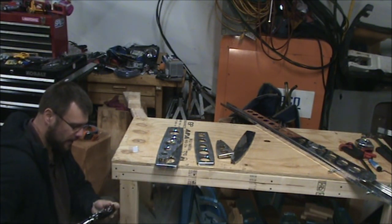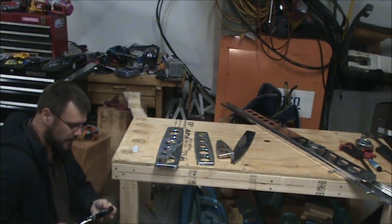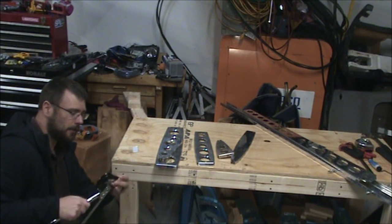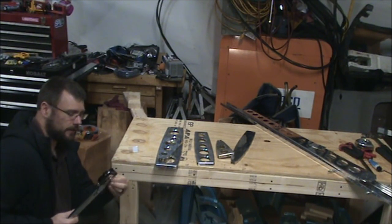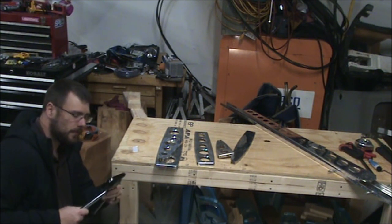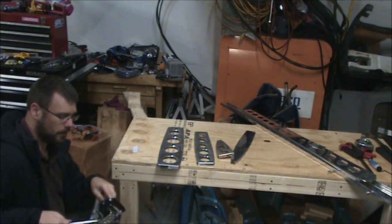It's because once you get up close to that edge on the table with the C-frame, there's a whole lot of skin being unsupported, and it makes it really difficult. So it's just easier to use the squeezer. And same thing with this, it's just going to be easier to use the squeezer. And on this, you're going to want to make sure to set the die with the protrusion on it on the ram. That way, you can fit inside this flange.